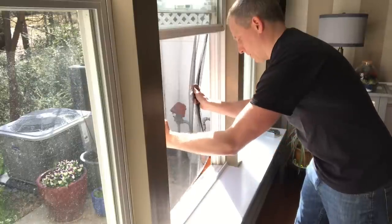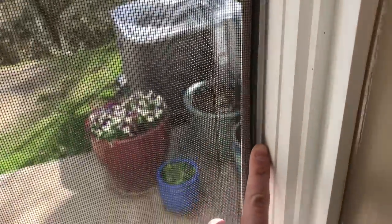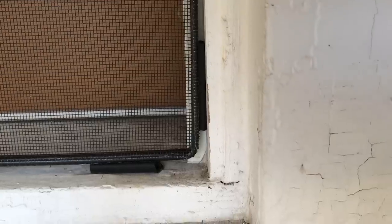When your FlexScreens show up, work them into the window openings and be sure that they have a little wiggle room, but not so much that they fall out when you slide them around. And if you have trackless windows, put the little bumpers on the edges and test them to be sure that they fit with decent tension, but not enough to sag the screen mesh. Those are your best sizing guidelines. That's how you use cardboard mock-ups or wooden dowels to help find your FlexScreen measurements. I hope this video was helpful. If you have any other questions, please feel free to call or write or reach out to the FlexScreen staff — they're very attentive people. I'm Ethan James with The Honest Carpenter Channel. Thanks for watching and enjoy your FlexScreens.